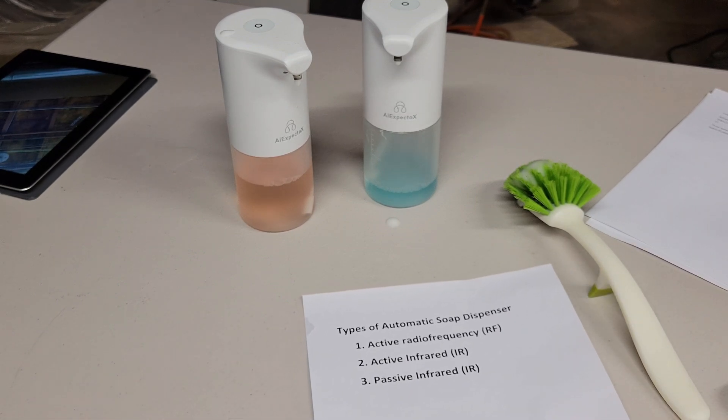If they were really paranoid, they could have each soap dispenser put out like an 8-bit random code and only look for reflections of that 8-bit random code. I also find that detection is pretty reliable in complete darkness or bright sunlight, so they've obviously done a good job of rejecting ambient IR light. So I hope you enjoyed this investigation of touchless soap dispensers, and I'll see you next time here at Coffee and Information.